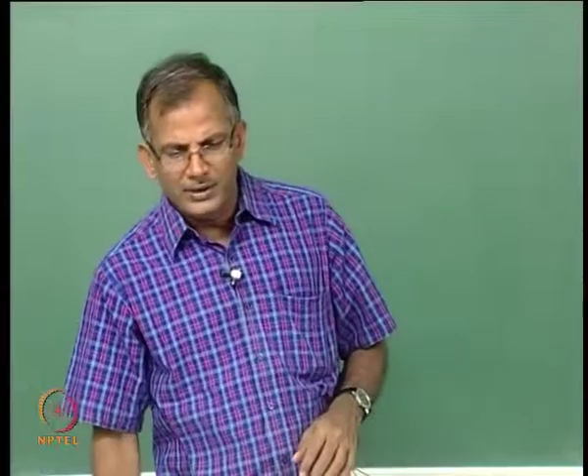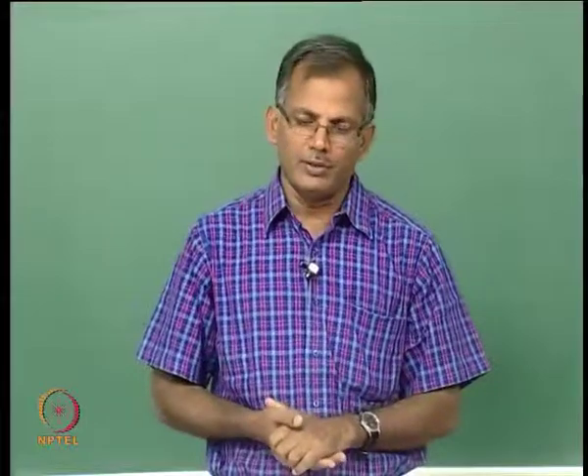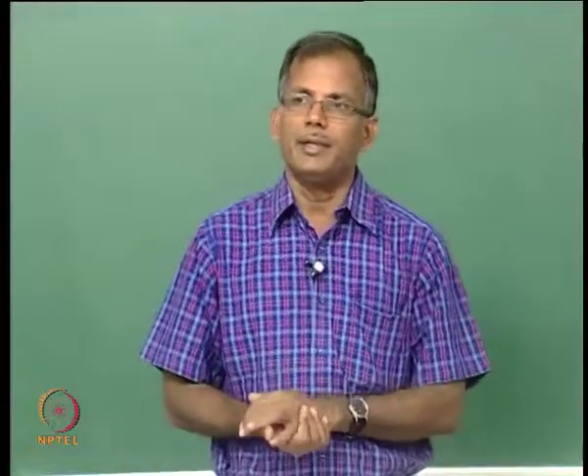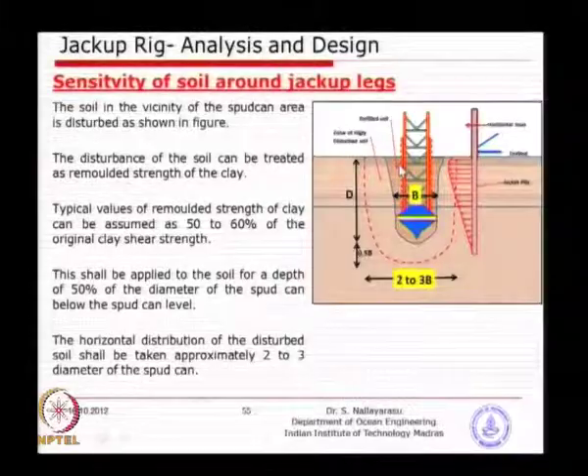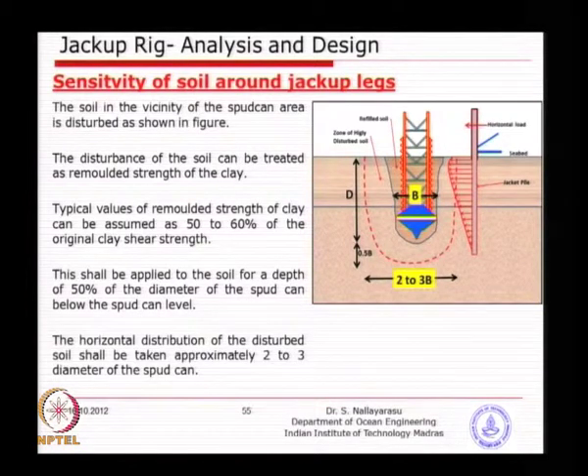We need to look at the sensitivity around the filled soil. Of course, after several weeks, the soil is filled before we start the removal. You will see that the soil is available to some extent — maybe not full, slightly smaller — but the characteristics will definitely be different from the soil in the near vicinity. If you want to develop a load-displacement graph for a particular location, and if the soil is the same in nature for several meters of distance from the pile, you can take those characteristics and develop them using existing methods. But a few meters away you may have a different soil characteristic, similar to the concept of layered soil but in the horizontal direction.